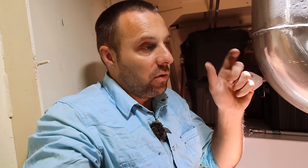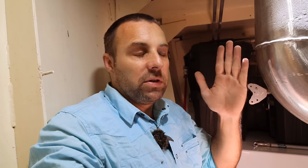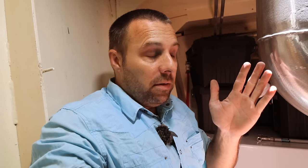So you can do little valves, you can get electric valves that block off exhaust and things like that, but you're opening up the possibility of something going wrong. If the valve doesn't work, you can theoretically create harm in the small engine of the two. There's a whole bunch of stuff that doesn't need to be there if you do two completely separate exhaust stacks. So in order to reduce risk, and because I don't know enough about the situation, I don't know what I don't know, I'm going to do completely separate exhaust for every engine in the boat.